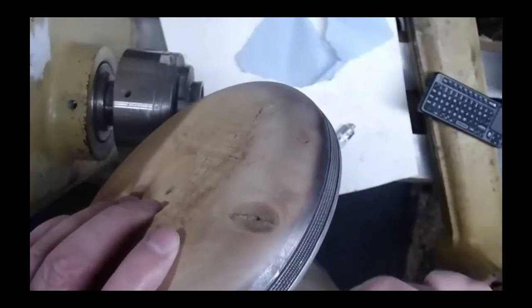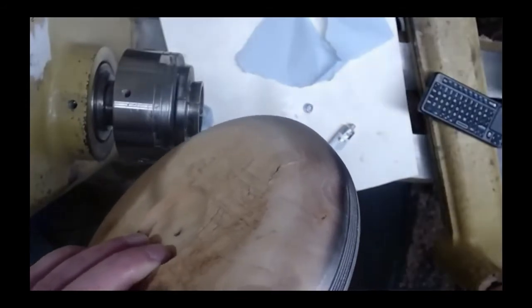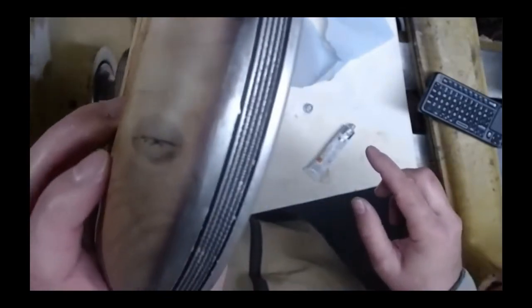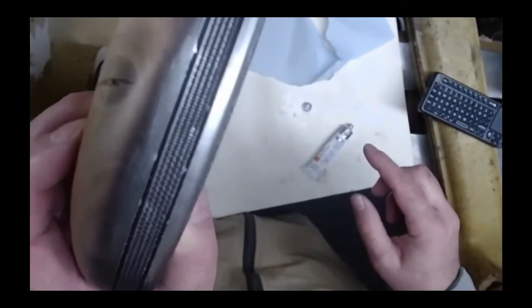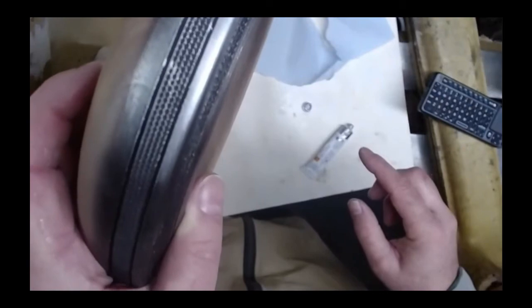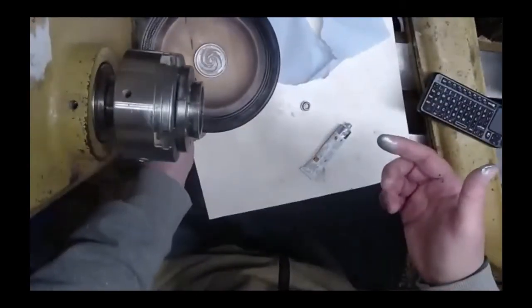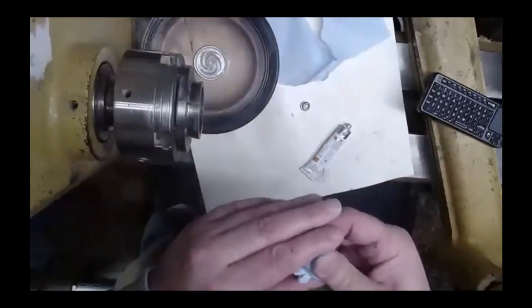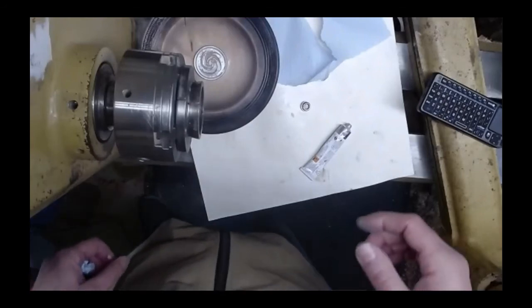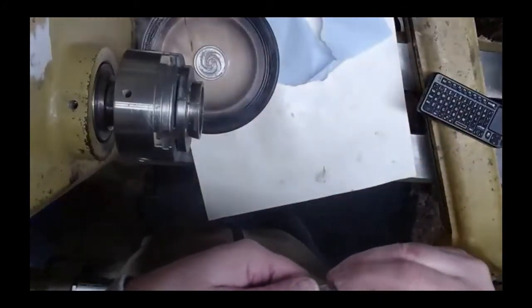Things are not flowing very well because it's only about 48 degrees in my shop after two and a half hours of heating. If you get gilt down in the cracks, can you brush it out? I've been able to pick it out with a pick, but that's enormously tedious — so it's better if you don't get it in there. Brushing won't work; it'll spread it. If you tried wiping it out with denatured alcohol and you're a little too heavy-handed, you're best just turning the texture off and starting from scratch.